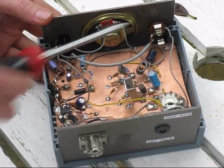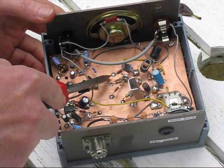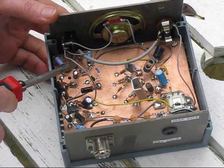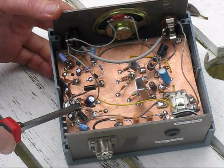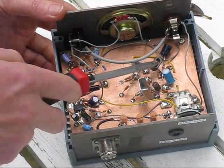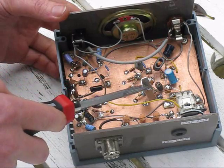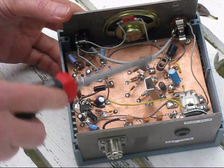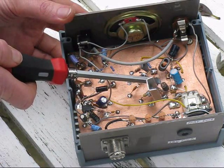Looking in the top: microphone socket, speaker, headphone socket. Circuit board material is used to mount all the parts. There's the microphone amplifier for the transmitter, audio amplifier for the receiver, and an LM386 on its back. The driver is a BD139 transistor with its broadband collector transformer. Another BD139 serves as the transmit power amplifier with a heat sink, and this is the ferrite used in the collector circuit of the final.